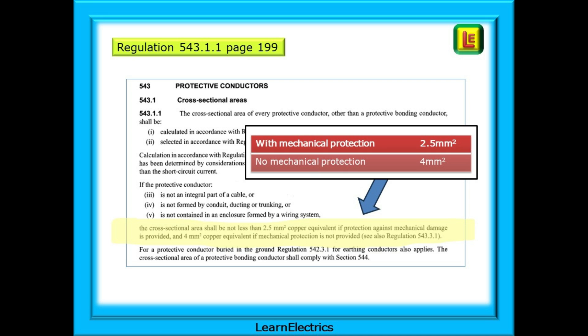This leaves us with two scenarios. First, the new protective conductor can be given mechanical protection throughout its length by placing it in trunking, sheathing or similar, or positioned behind a physical barrier that prevents inadvertent damage. In this case, the CPC must not be less than 2.5 square millimetres in CSA, or greater if the adiabatic equation or tables suggest a greater size. Second, if there is no mechanical protection provided — if it is just a CPC conductor laid across a loft or other area — then the minimum size should be 4 square millimetres or greater as per the adiabatic equation. These sizes are not indicative of the fault currents expected to flow; rather, they are to give the conductor greater mechanical strength so that it will not break easily if tripped over or caught by some object.